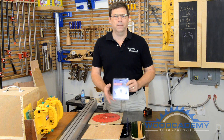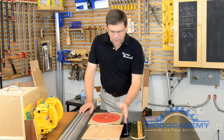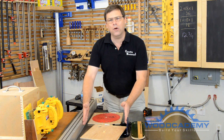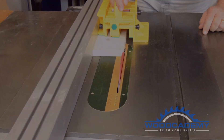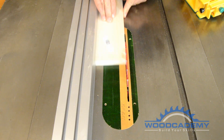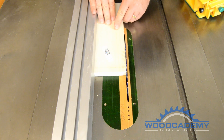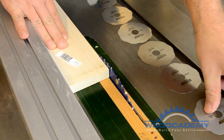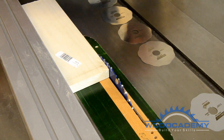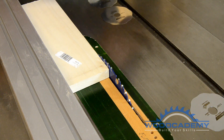The blade match arbor shims are designed to solve this problem. They allow me to set up my saw so that no matter what blade I put in, the right side of the blade — the fence side — is always in the same plane. You can see what I mean here: I cut a part using a full kerf blade and it fits snugly, but swap to a thin kerf blade without moving the fence and it becomes obvious that the right side of the blade is further from the fence. The arbor shims allow me to figure out the exact gap.